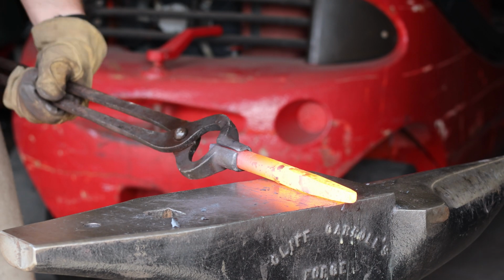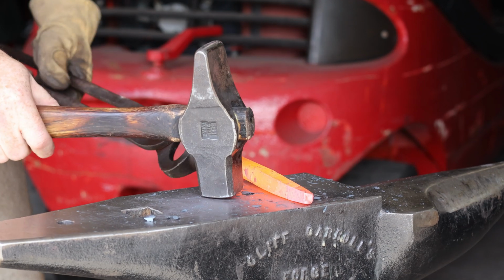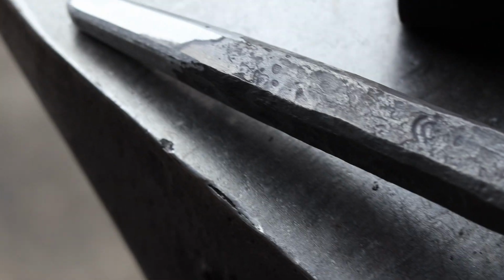Most of the punches and chisels that I've made, and those that I've featured on this channel, are forged in the style of Mark Asbury, a mastersmith in California, and this was the first one that, while I did take elements of his general design, I forged to be not really of anyone else's style. It's got a thin, kind of rectangular profile down to a mostly square but still octagonal tip, and then ground to that fairly sharp point for the center punch portion of the tool itself.